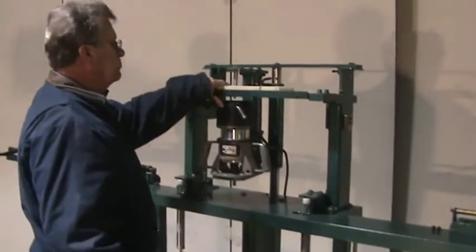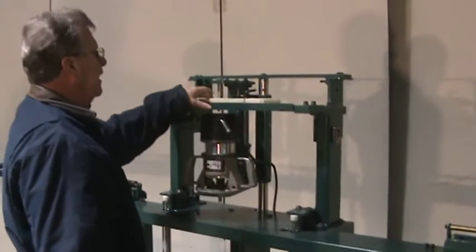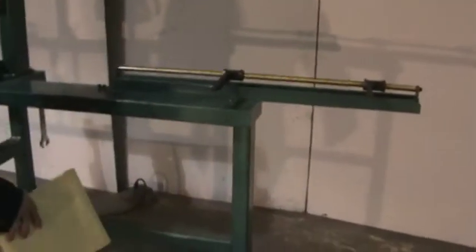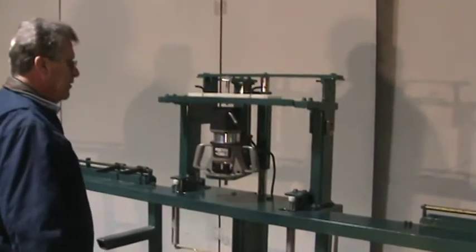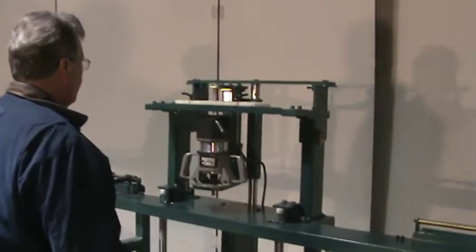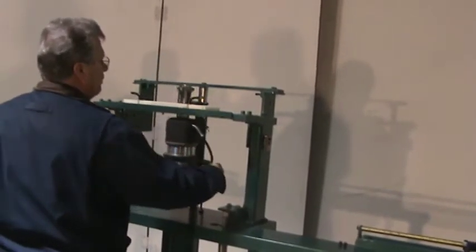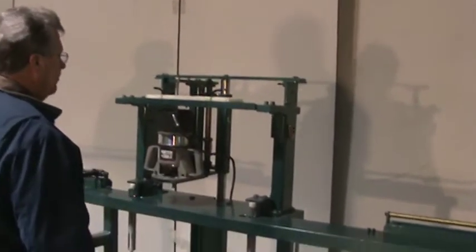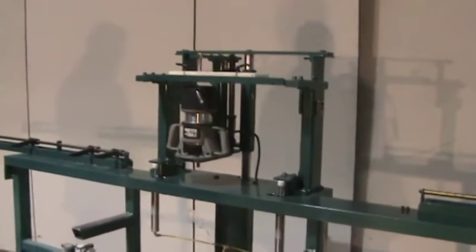And what we did was we just put two hinge pocket strike pockets in here 8 inches apart, and then they set these in to where they came out right, and they could route both their deadbolt and their regular standard strike without moving the jamb, left hand and right hand, and they just used the same template. These templates actually will travel more than 12 inches, but what Cabal builds theirs at is 12 inch travel, and that's really all anybody ever needs.